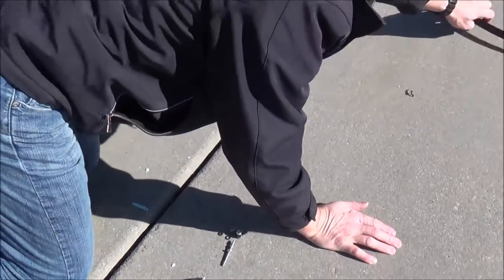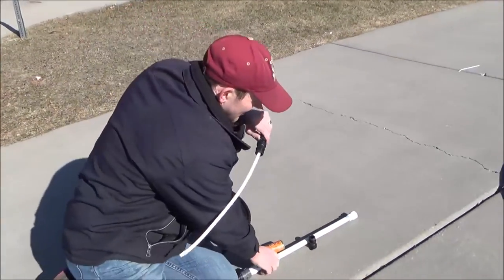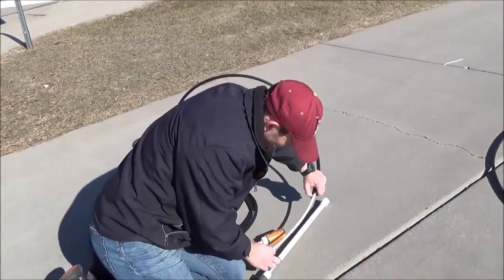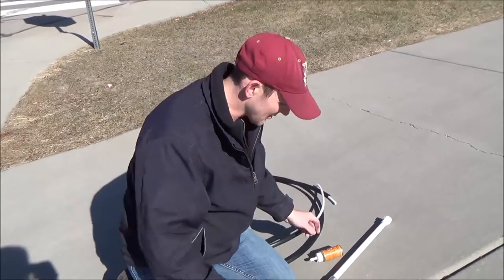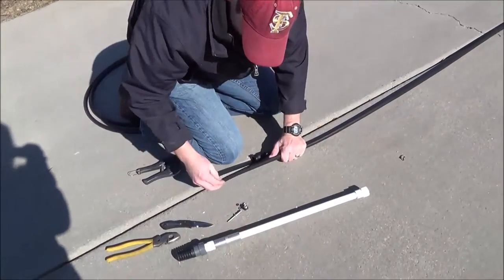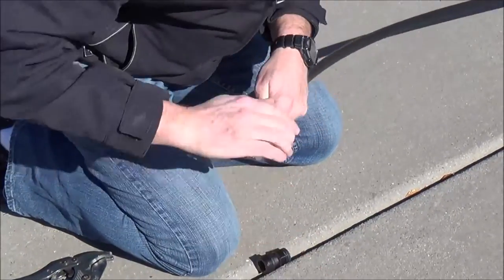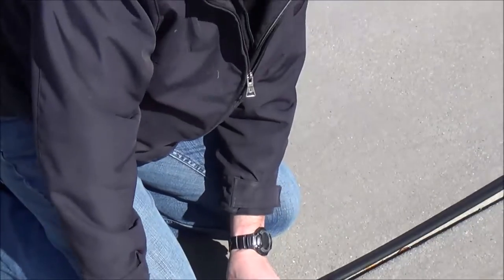So now what we've got to do is cut back the black tubing just the right length so that we've got enough white tubing to run our pump, but not so much that we snag it when we're pumping. I'll show you a trick for measuring it correctly. I'm going to cut away just a little bit more of this black tubing so I can hold onto the pex better, being careful not to put a big cut into the pex — just kind of going around the outside — so I can tug on it a little bit. I'm holding onto the black and pulling to make sure I have as much slack out of the pex as possible.